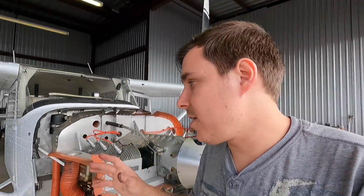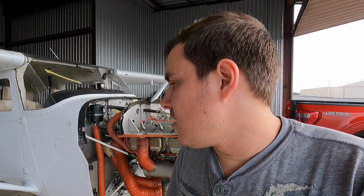That's how you change a brake pad on an aircraft. It was kind of a quick video. Like I said, make sure you're using your approved data for this. In this case, it would have been the Cleveland Wheels and Brakes service catalog and not the AMM or anything else. So I use that. What else do I want to say on it? Make sure you vacuum some of the extra fluid out of there.